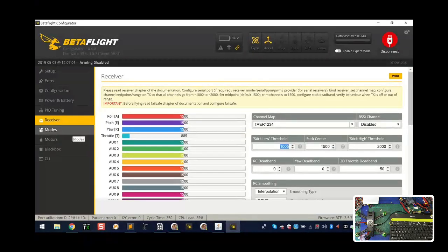As far as modes go, I'm not going to cover those right now because I don't have a transmitter set up for this - I'll come back to that in another video. My main point is: start doing ESC calibration and go back to the basics so you can see your ESC numbers and catch any problems. After a test flight, if you want to go to DShot and your board supports it, go for it - but there are other settings to adjust then. Start with the basics, make sure your quad flies straight, and make sure your motors are calibrated to give power evenly. If you need anything, hit me up. Have safe flying this weekend, be blessed, and take care of each other.